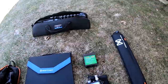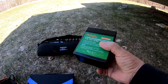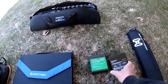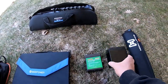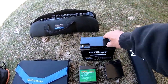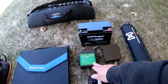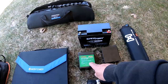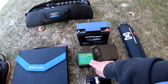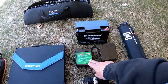I've also got a new type of battery I'm going to be showing here: a lithium iron phosphate battery that weighs one and a half pounds. Compared to sealed lead acid batteries — this one is approximately five pounds, and the bigger battery I had for the other radio was probably more like 15 pounds. This new battery is six amp hours, so with the radio I'll be using I'll get about 12 hours of receive time or approximately two to three hours of transmit time.